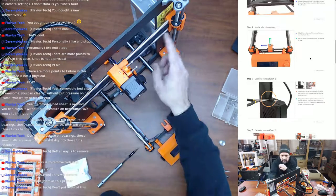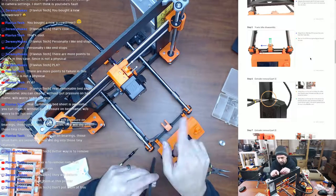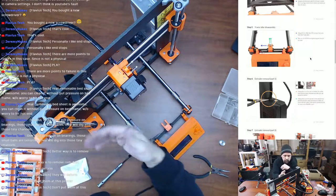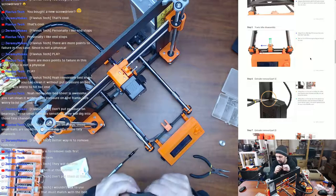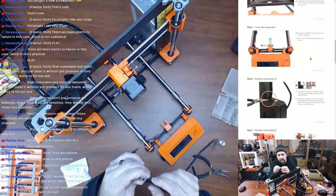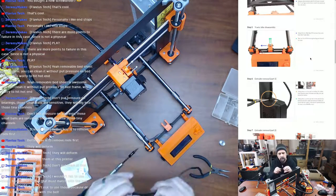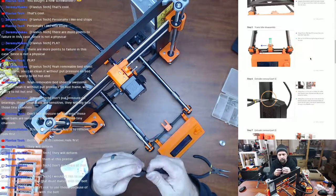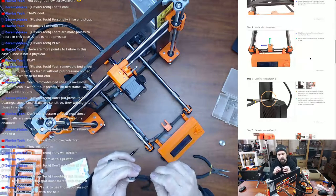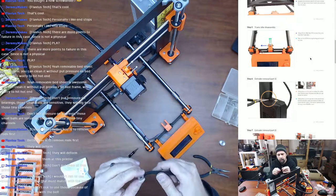I noticed on my X-axis that the belt wobbles back and forth, and it kind of walks back and forth as the extruder goes back and forth. And I've tried to make sure it's all in there. Now they match the belt. They're GT2, and it's the same spacing. I made sure to get the same spacing and everything. You may be right. I may not want to, but I'm playing with it right now, and this is spot on. Like, there's no crunching whenever I'm running it over.